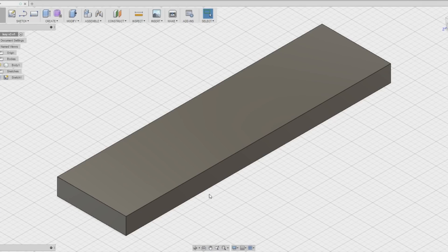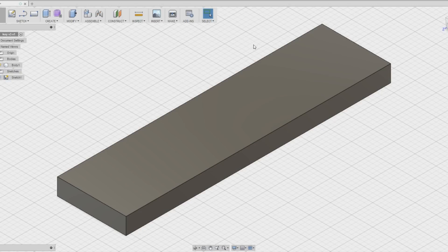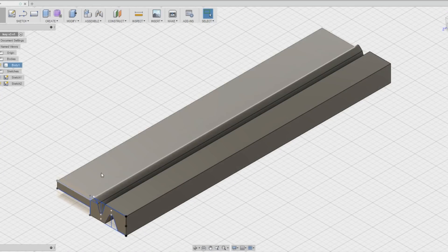After the failed print, I decided to scrap the whole 3D scanning route and go straight into Fusion 360 and model this up myself. I started out by sketching up a rectangle and extruding it out to the width, length, and depth of the key shank. Once I had the basic shape, I went ahead to the front profile of the blank and sketched out the grooves I needed. After playing with the dimensions a little bit, I extruded it out and had a nice, perfect key blank.